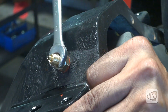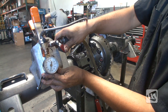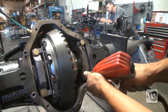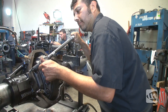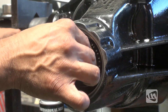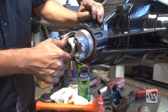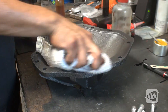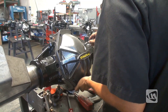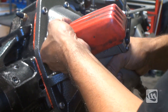The airline is now connected to a bulkhead fitting and then a test is performed to ensure there are no leaks. The cap bolts can now be tightened to torque spec. Back at the pinion, a slinger and seal are added before the yoke is installed and secured in place with a pinion nut. With the installation of a heavy-duty Dynatrac cover, the assembly of the differential is now complete.